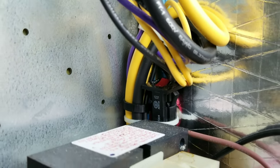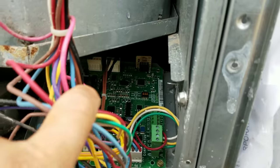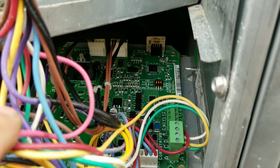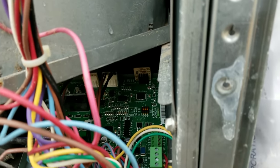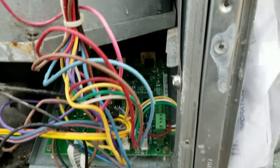I have a feeling it's probably out of range, so it doesn't know that the unit's actually frozen — which happens quite often. It's probably going to be either those sensors going bad or possibly the board. I do see a little bit of corrosion back there where the outdoor fan connects. There's also one of those little 3.2 amp resettable fuses — I'm not going to take this one since we're not condemning the unit. I'm going to shut the camera down, disconnect that, get my multimeter out and my 10k ohm resistance chart, and see what those sensors are reading.